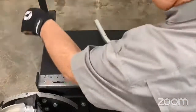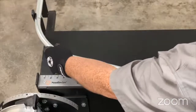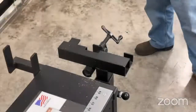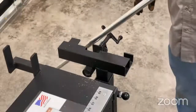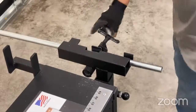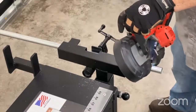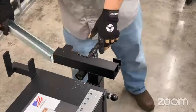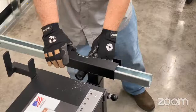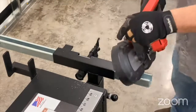If your conduit's got a kick in it, we have this adjustable lever here that you can pull up so you can push your conduit up tight against it and take a nice measurement without having to find a wall. To cut the conduit, instead of doing things we used to have to do, it's got a built-in quick vise. You just lay the conduit in there, tighten the screw down a few turns, and have a nice stable surface to work off, allowing you to put both hands on the tool. If you're hanging racks and need to cut some strut, you just slide the strut through the box channel, tighten down — it's nice and secure, letting you operate that tool safely.